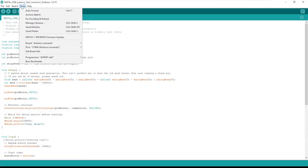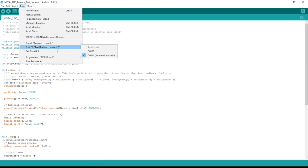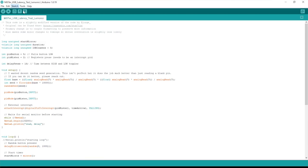To control the lag tester, we need to upload code into the Arduino. You can find this code on Mr. Add-ons' GitHub — I'll leave a link in the description. It's a simple page of Arduino code that fires off a signal down one pin, waits for a return signal on the other pin, and calculates the round trip time. Load the project in the Arduino IDE, set the COM port and board type, then compile and upload it to the device.